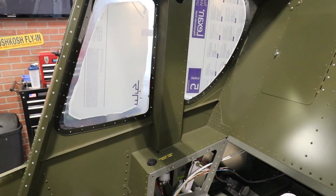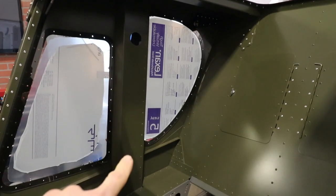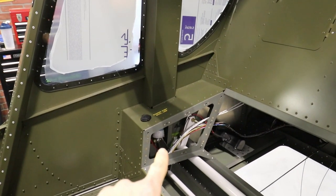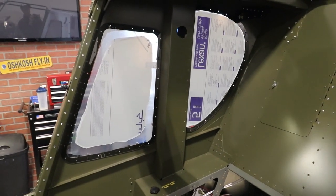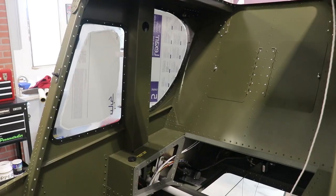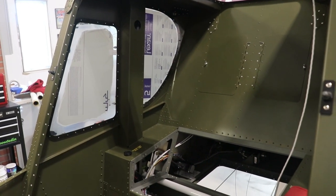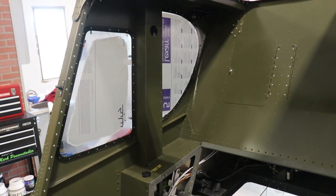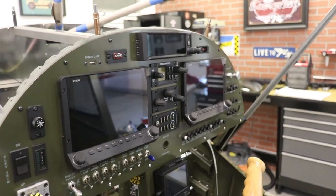Another area on Zenith airplanes where a builder really needs to think ahead is when riveting on these big rectangle pieces. Some builders will rivet it all together and then realize there's a push rod that goes from down here all the way up, and if you don't install that push rod before you rivet this, there's no way to get it in. You have to insert the push rod first, then put the cover on and rivet it in place. It's easy to forget because usually a builder is just in the middle of riveting the airframe with none of the flight controls in yet.